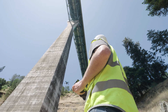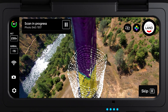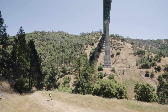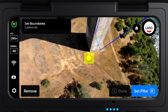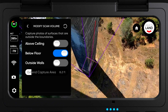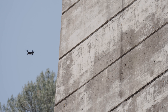Another way you can use your drone for bridge inspection is Skydio 3D capture, which is available with a 3D scan license. This mode automates the capture and inspection process for large, complex structures like bridges. With very little input from the operator, your drone will create autonomous flight paths to capture your structure from all angles. Simply set up a volume where you want the drone to operate in, adjust your settings, and your scan will automatically capture all the photos you will need. This data can be reviewed on-site, backed up to Skydio cloud, or used to generate digital twins with photogrammetry software.